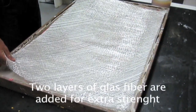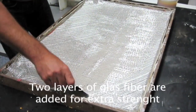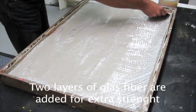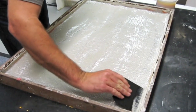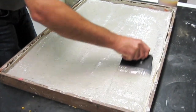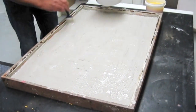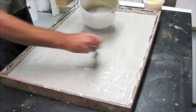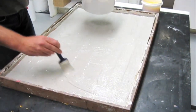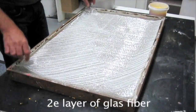You can add as many layers of A1 triaxial fiber as needed to create the desired strength of the panel. Add the first layer of A1 triaxial fiber and even the surface with the scraper. Brush on some more A1 mixture and make another layer of A1 triaxial fiber. Ensure that you wet each layer of the A1 triaxial fiber completely with the A1 mixture, and even the surface out with a spatula, scraper, or brush.